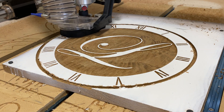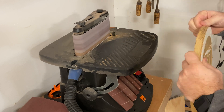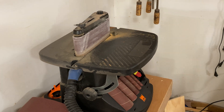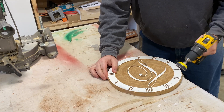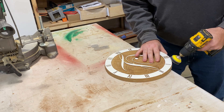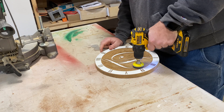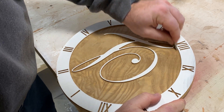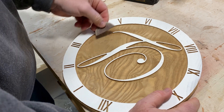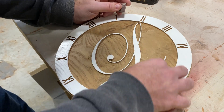I swap it out for an eighth inch bit and then finish up the cut. From there, once I'm finished, I go to the spindle sander and give it a nice cleanup on the corners. Then I pull up my drill and I've got these handy dandy sanding discs that I found on Amazon — they have grits from 60 grit all the way up to several hundred and they do a really good job of getting into those corners. I recommend you pick some of those up if you do anything with CNC work — there's a link down in the description. For any of those burrs that are a little harder to get rid of, I take one of those little sanding discs, fold it up, and use that to get into those corners and edges. That actually does a really good job.